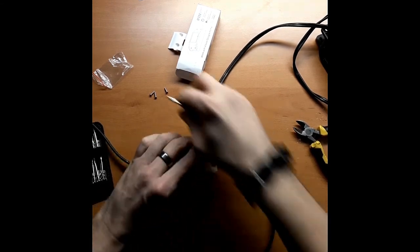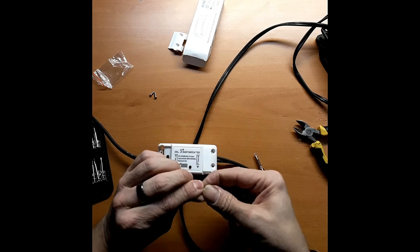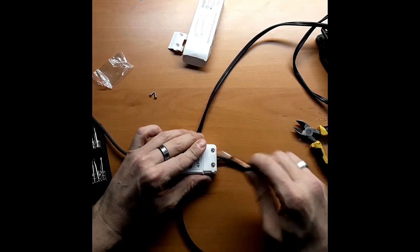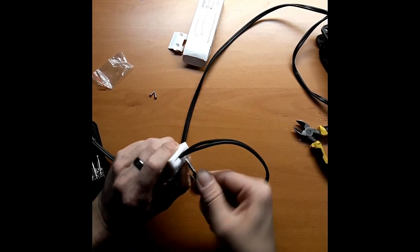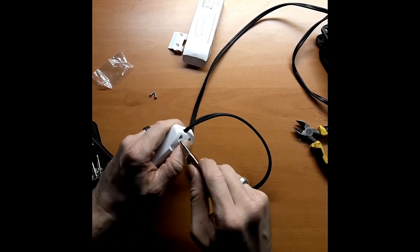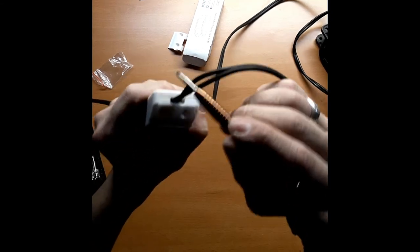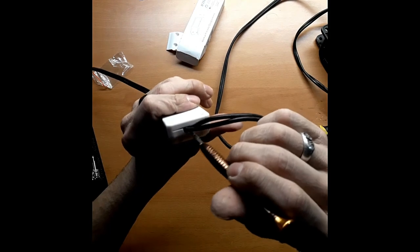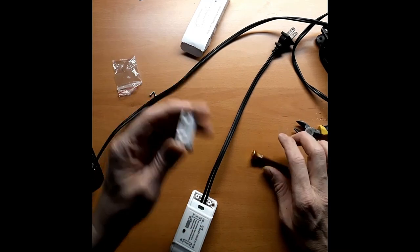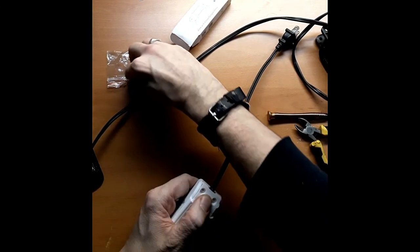Now these, again, like I said, you just pop them in place, secure one side down just a little bit, and because it's a crimp connection, kind of like a seesaw, how far you do down one dictates how far the other one's going to be allowed to go down while crimping the wire in place. So if you want to have fairly equal and no lips on either side, you want to make sure that you adjust those accordingly. You also don't want to have them done up so tight that these plastic teeth in there run the risk of actually biting through the insulation on the wires. They're plastic, so they won't cause a fire or bridging or anything like that, but it can lead to a weak spot.